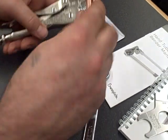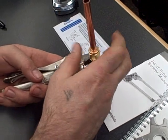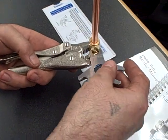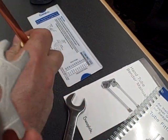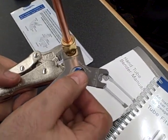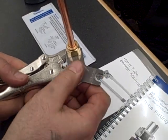Let's put it back on and show how the gauge works. Take a short bite on it — it makes it easier to turn. On the remake of the fitting, once it's been pulled up the full one and a quarter turns, it's just a quarter turn that needs to be tight. That's how we know it's properly made up.